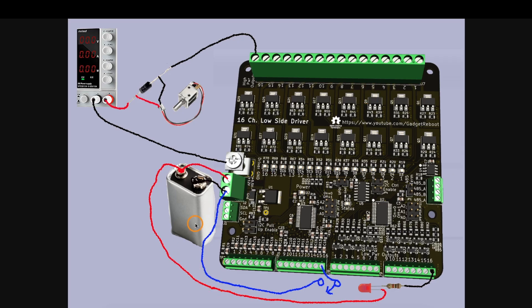To test the various features on this board, I'm powering the logic from a 9 volt battery. Since these outputs are open drain or open collector, only connecting an external load to ground, we need an external power supply. To power solenoids, I'm using a bench supply. For an LED, I'm using the 9 volt battery as an external supply, so when the low power output is turned on, this pin connects to ground and the LED comes on.